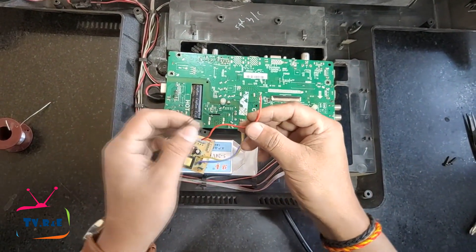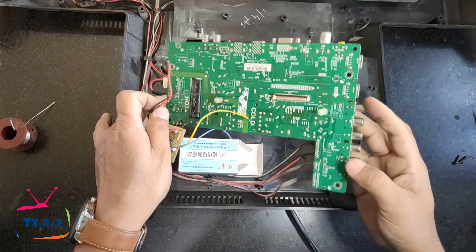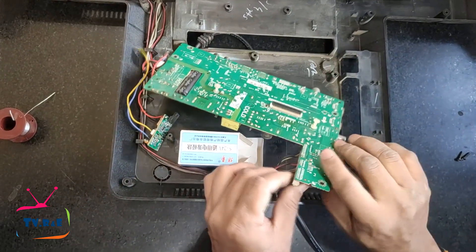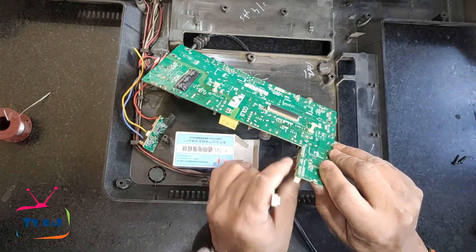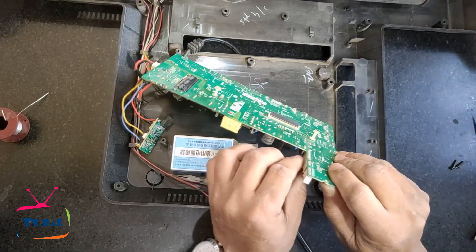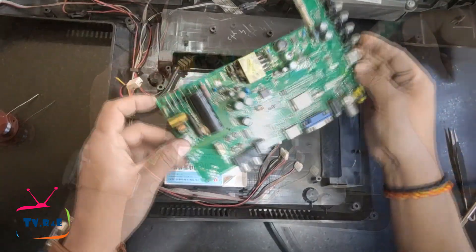The red and black wires need to be connected to the same points as before — with the black wire connected to the negative terminal of the main filter capacitor and the red wire connected to the drain connecting point of the power supply MOSFET. So let's connect these two wires to the power supply.